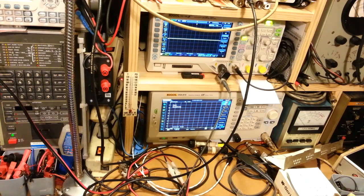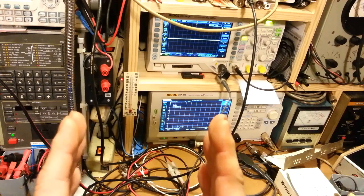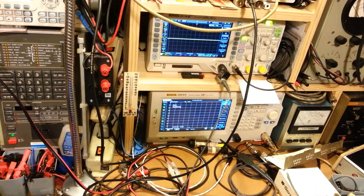If you're like me, you want radios that are fairly narrowband. Narrowband radios, yes, you do lose some audio definition, the quality and tonal qualities. I always look at it this way: it's AM CB radio. You can only get so much fidelity out of an AM CB radio. You're not transmitting high fidelity FM stereo. So the whole thing I want to do is try and filter out noise. And that's why I want it narrow-banded, especially the receiver. I want that squished down as far as I can. There's a happy medium. You're going to reduce your audio bandwidth, but you don't want to reduce it to the point where you start to interfere with being able to hear somebody clearly and at least halfway acceptable. But you want to block out the most amount of noise.